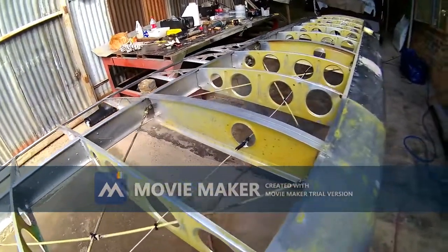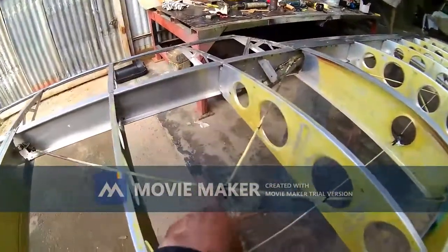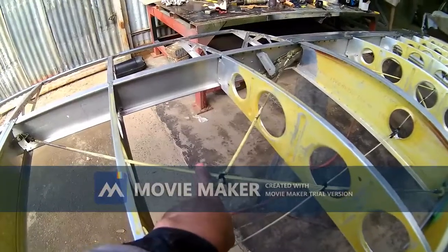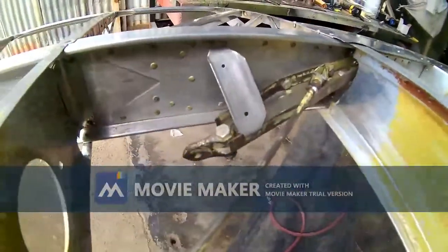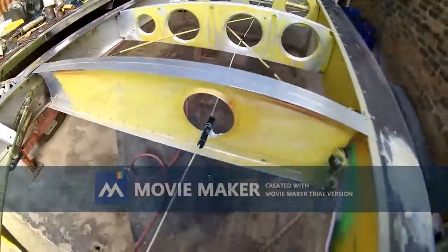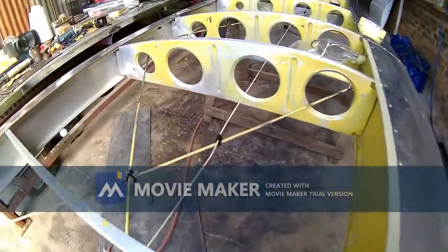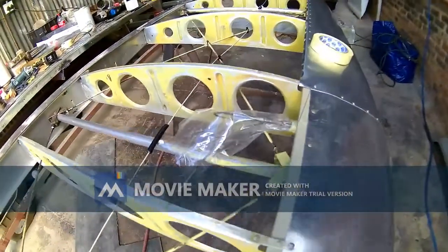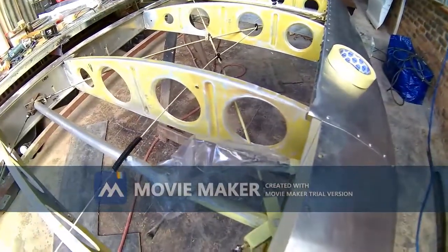All the anti-drag wires were taken out. All the threaded fittings were cleaned. You can see the strut attached fittings there. New wiring for the nav lights. Here we're busy masking the cables for the painting process.